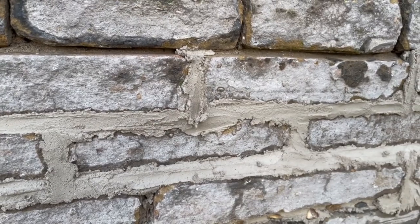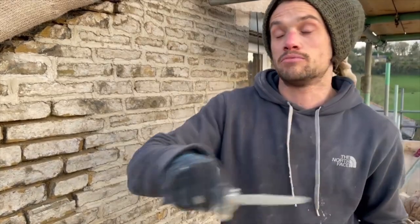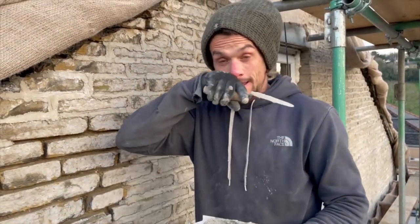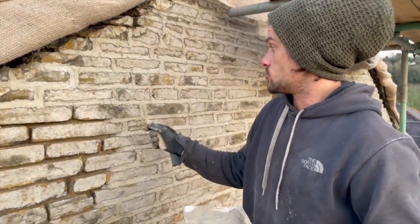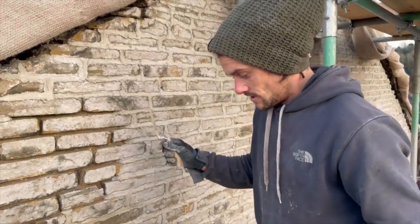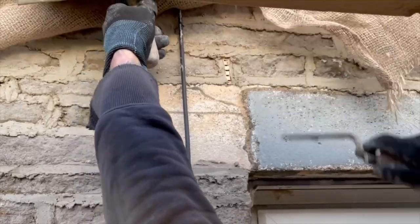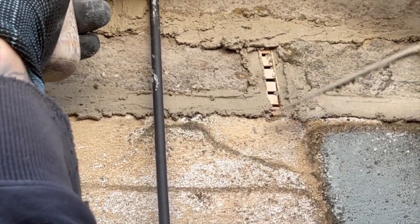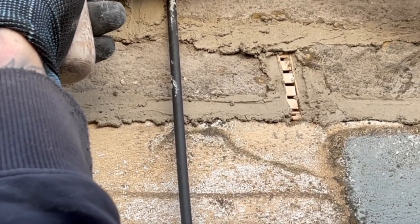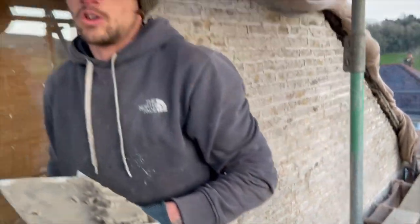Because this wall was so laden with water we've used lime mortar so any water locked in that cavity isn't going through into the house - it's escaping to the elements where it should be. Because it's so wet we've also added quite a lot of perp vents into the structure. We drill into the perp to make it about 10mm wide outside, then sit plastic one-way vents in. The wind can blow air in, and with 20 of these vents plus the existing air bricks in the wall, there's a lot of air moving through that cavity now - it'll dry out a lot over the next 12 months.